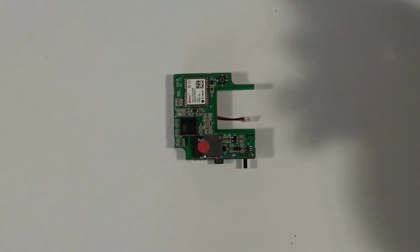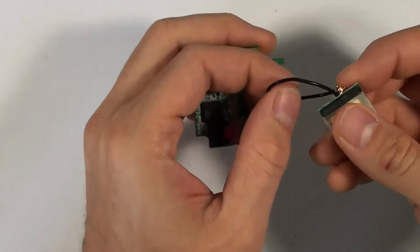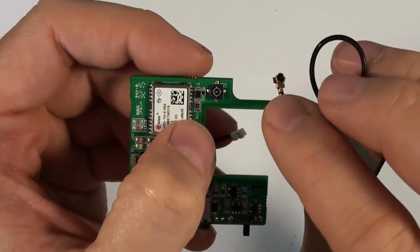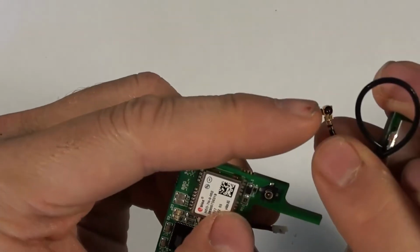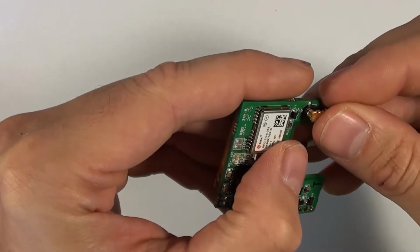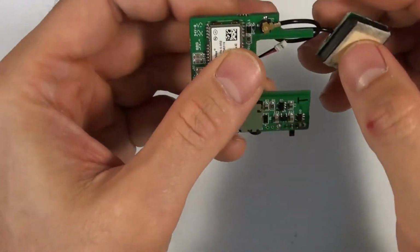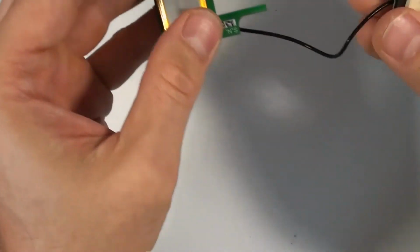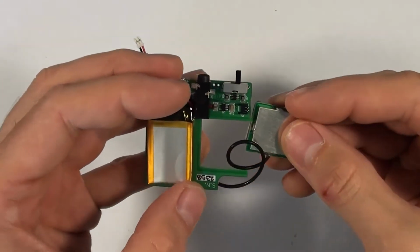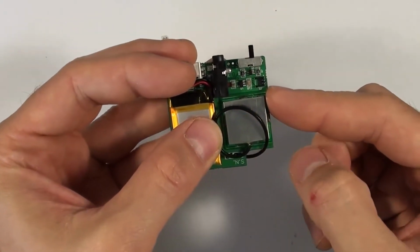So I'm going to put the vise away, and then I'll put the antenna back on. To reinstall the antenna, you want to take the connector with the black side facing toward the board, and you're going to put it right on top of the connector on the board and push straight on until it clicks. And there's this little curl, so I usually take these antennas, pass them around themselves like that, and then in there, and that'll give you this one turn of the cable.